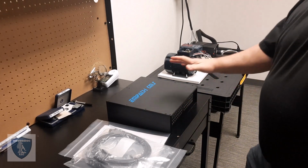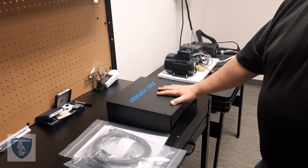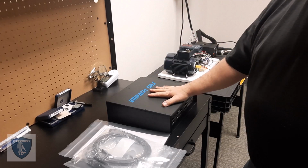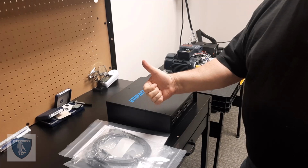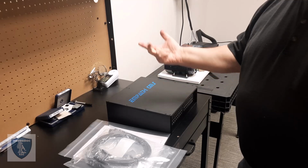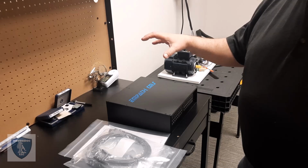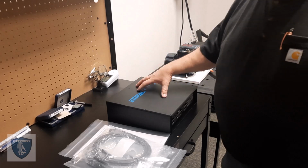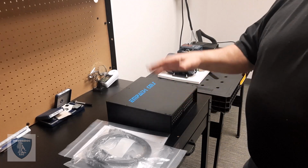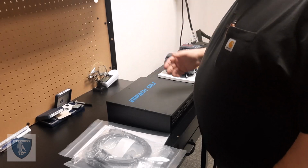Now, unlike an ECMS E1, I take data once an hour with this one, but it also brings my per point cost or per machine cost down. A machine analyzed by this means power quality coming in. It means the electric machine electrically and mechanically, the coupling, whether that's a belt or a direct coupling or a gearbox, and the driven equipment is 1 point. So it's not like vibration where I should have 6 points on a machine, etc.